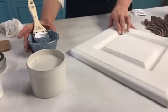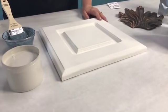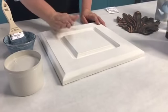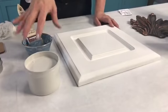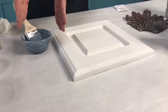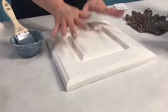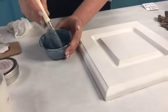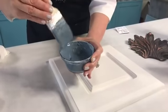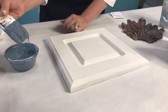Here's another major difference: with our One Step paint we can put it directly on top of oak, cherry, mahogany — anything — after cleaning. Milk paint is totally different. I cannot put it directly on top of something that has a lacquer finish — it's not going to adhere unless I want to heavily distress it. I need to either put a bonding agent in it, or what I prefer: put it on top of a coat of One Step paint. That One Step acts as a binder and prep coat.